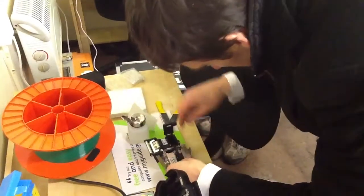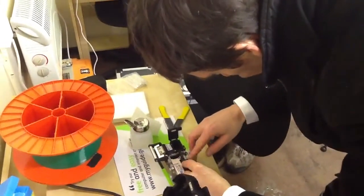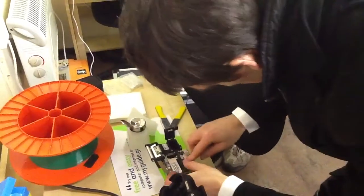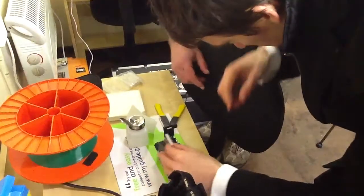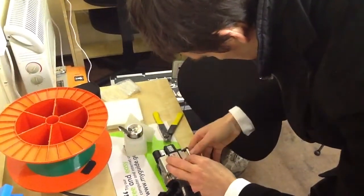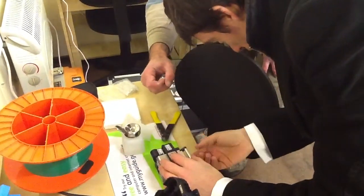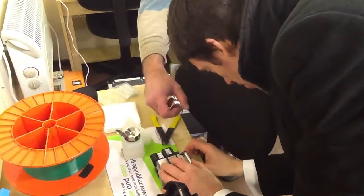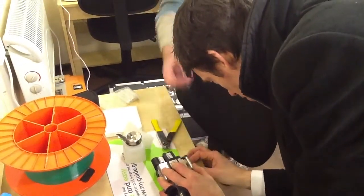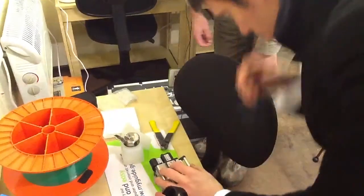Coating at the ten millimetre mark. Lower that clamp first — it's got a little magnet. Lower that one — it doesn't push down yet. Push that one all the way down. You have to flick that blade — as quick as you can, just flick it forwards. If you flick it with the ends of your finger, it tends to work best. That's it — and then it's sure you've cleaved it.